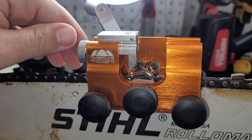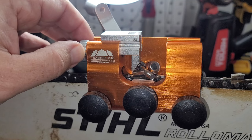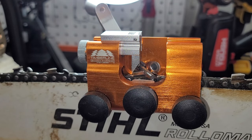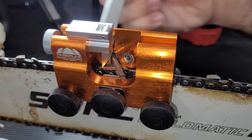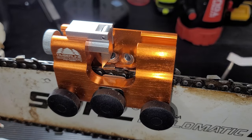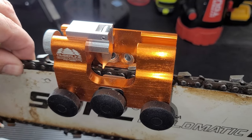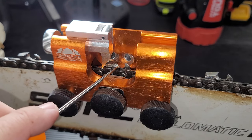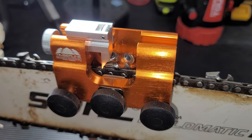We'll just put a little light pressure on the front on those two outer screws and get everything squared up. You can see that even at this point the gap is pretty well gone, just a little bit at the top. Then we push our block and pawl up against the back of the cutter head. Give her one final tighten and you're ready to go. Now we'll take a look at how to actually perform the sharpening. I'm cranking the little handle and pulling it out — my typical go-to is to crank on the way in and crank on the way out just so it gets a full range of motion. Here's the gullet, and by now we should all know that you're sharpening the top ledge of the cutter head.